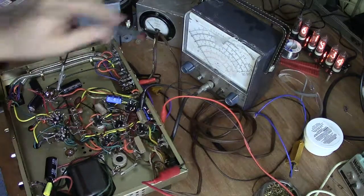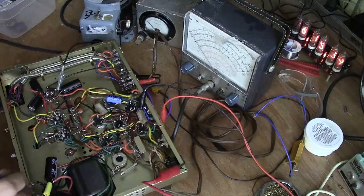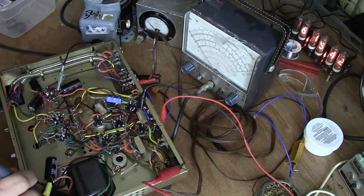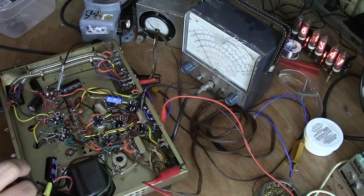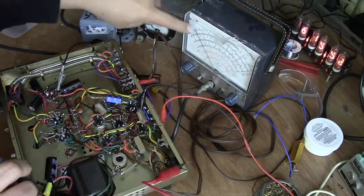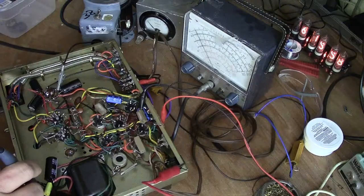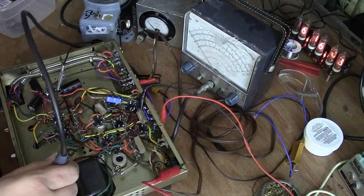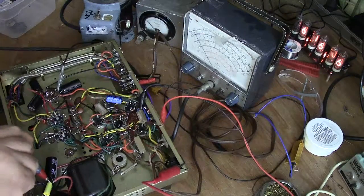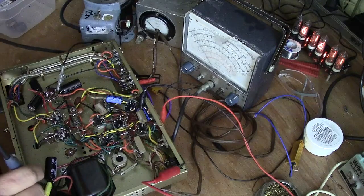So first thing we'll do is we're on the 500 volt scale over here, so full scale is 500, and we'll go ahead and get on the output cap here for the voltage doubler and start turning this up. And so I'm going up here. We don't see any rise over here on the input AC current, and I'm now currently at 50 volts. So that's about 50 volts on the output from the doubler. And if I look at the junction of the 2 capacitors on the doubler, it will probably be half of that, which is about right. It's about 25 volts. So that's looking good.